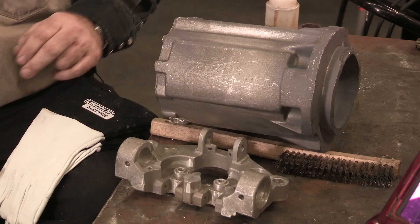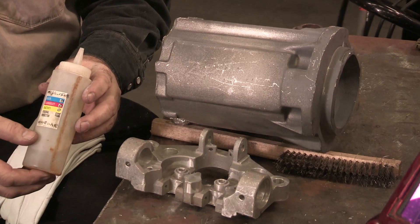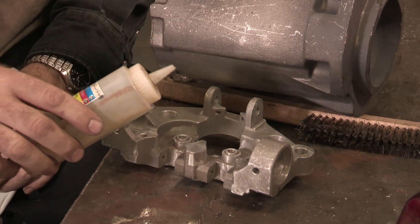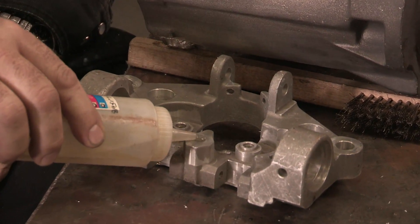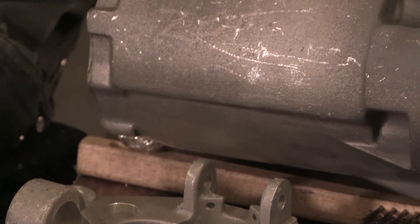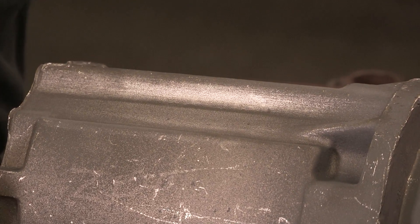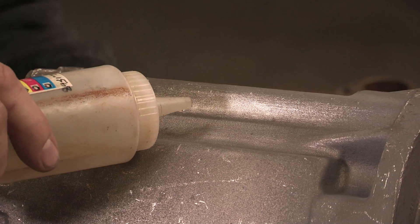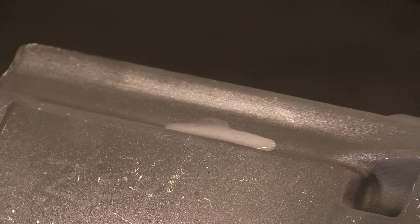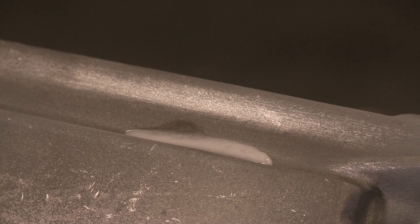What I'm going to do is test these two with a special solvent — white vinegar, the same thing that's in your kitchen. I'm going to pour some of the white vinegar on this first casting and we'll see what happens. Well, it just kind of lays there like white vinegar. So now we'll check this other casting and see what happens. You can see that foaming action there — it kind of looks like peroxide when you put it on an infection.